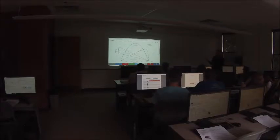Basically, the wire is going to get hot when you dump 131 amps through that wire. So that's how you smoke a motor: you don't allow any back EMF to slow current down. You dump a whole bunch of current through it, the wire heats up, the casing melts, and the motor shorts out internally. So when you smoke a motor, that's what happens.